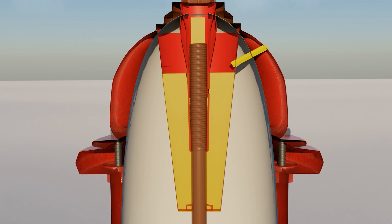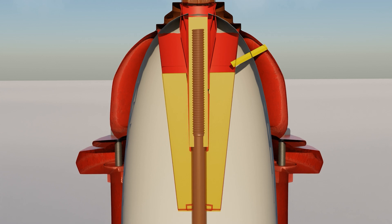As the hydrant begins to close and the stem covers the hole, the oil is trapped and forced back up, out of special openings above the thrust collar. Lubricant flows over all the stem threads and bearing surfaces before going back down into the reservoir.